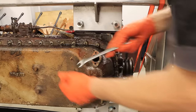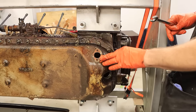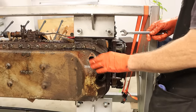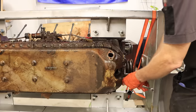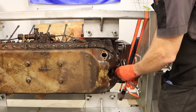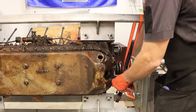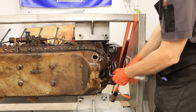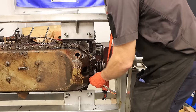This feels and looks to be aluminium here. I've just sprayed this old gasket area here with a little bit of heavy lanolin to stop any fibre coming off, because these old gaskets are likely to contain asbestos. So if we keep any airborne fibres under control, that keeps us all safe.